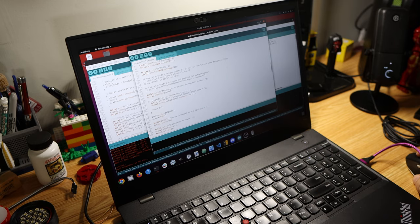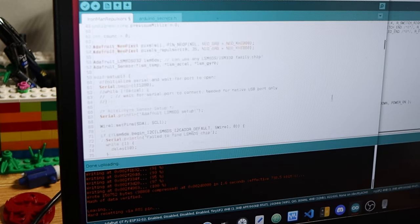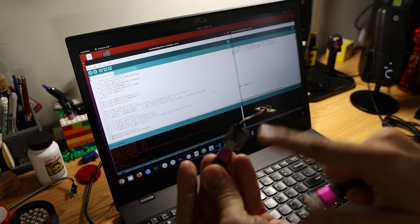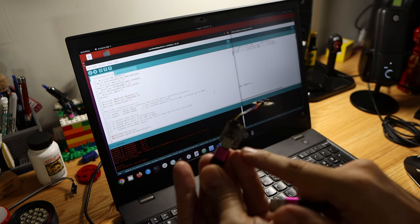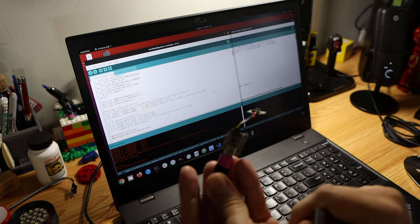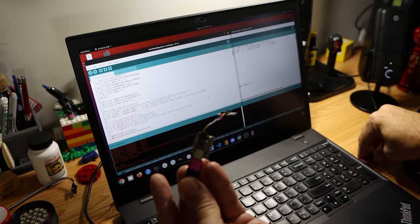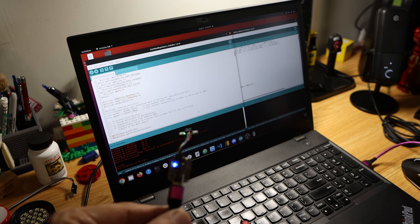I then took that template and from it moved on to my Iron Man repulsors code, adding things very specific to the repulsors. When I plug this in, you'll see a red LED — red means it's turned on but nothing has happened yet. Then a green LED will come on if it's connected to Wi-Fi. That green will immediately transition to blue if we're talking to the MQTT server, which is actually sitting on the Iron Man primary computer in my garage downstairs, all connected to Wi-Fi. Red, green, blue — that's exactly how it's supposed to work.